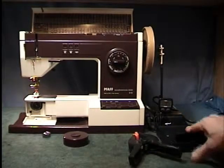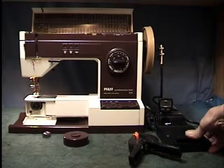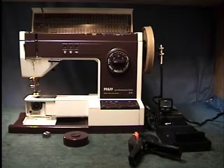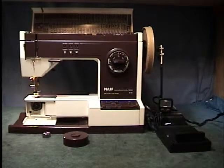Now, what I want to do is, if you could see the tachometer down here, if I start the machine the tachometer will start reading and it'll go up faster and faster. I have the machine set on medium speed because I want to see how consistent it is, whether it's going up and down, because that's what the problem was with this machine — it would go up or down and start losing power, according to the customer. But the thing is, whenever you have a foot pedal and you're pressing down on it, your foot gets tired a little bit and you're going to raise the foot pedal up, you're just not going to keep it at a consistent speed like if you put a clamp on it.